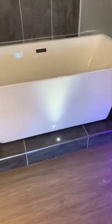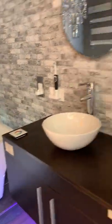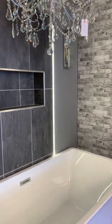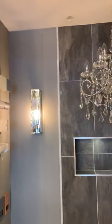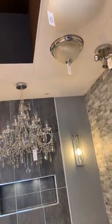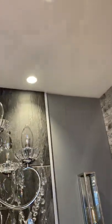Next is 'Bar' — these are just the little projected LED uplights around the bath that come on. Then we have 'Mirror' — I've also commissioned that to send a signal to the vertical LED tape that runs in the profile behind the tile, so you get the whole group come on together as one. Then we have 'Relax' — just the wall lights, really nice simple warm white wall lights, and you can dim them. Then we have 'Wall Wash' — just the baffled LED spots, 100mm off the wall, you get that lovely curve of light. These are popular over his-and-her sinks, in walk-in showers, or anywhere you want a little drama in the lighting design.